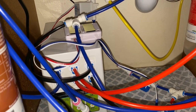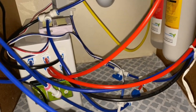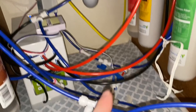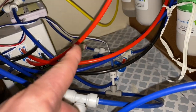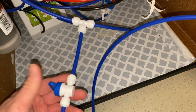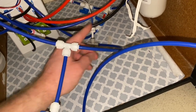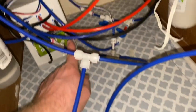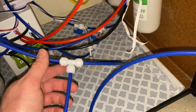You can hear the system running. It's pushing water through because some of this stuff wasn't full. What I just figured out is that because I did the bypass, it does make the flood guardian activate. What I need to do is get another one of these shutoffs and clip it on here, so when I'm going to fill up a bucket I can shut it off — because the bypass is going to cause water to flow through there regardless.